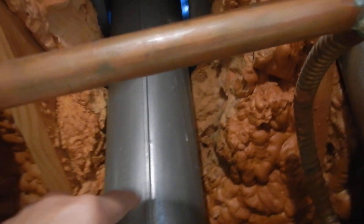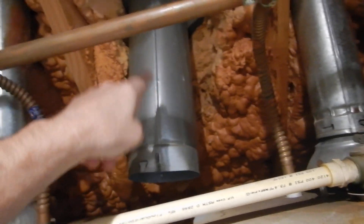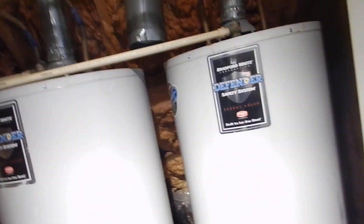These are the water heaters and the first thing I'm seeing is daylight around the flue. This is the fresh air induction. This high up should actually be the makeup air, and we'd get our fresh air from someplace down here.